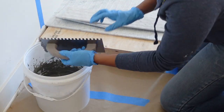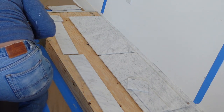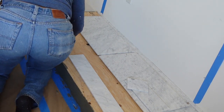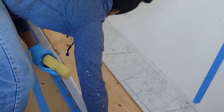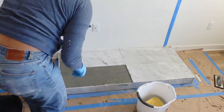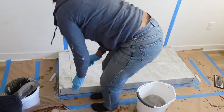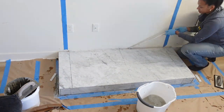You need a trowel with ridges. The idea is to spread it on smooth, then go back over it with the side that has the divots — it just helps the tile adhere to the plywood and thinset. Then use a grouting float to push it on so everything is even and level. After that, go over it with a sponge — have a bucket of water nearby to wipe off any thinset that squeezes through the tile so it doesn't dry on the surface. For a larger surface area, if you're not washing it down as you go, you risk having thinset dry and being very hard to remove.